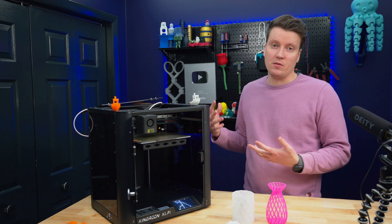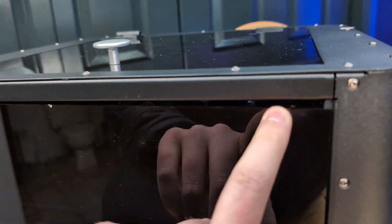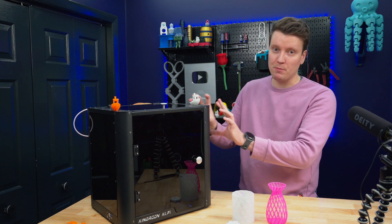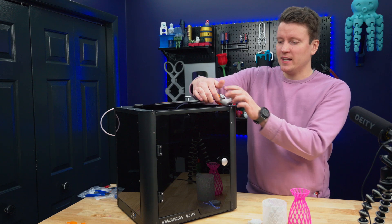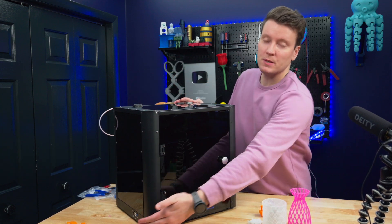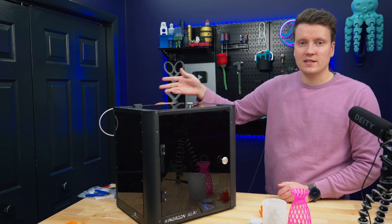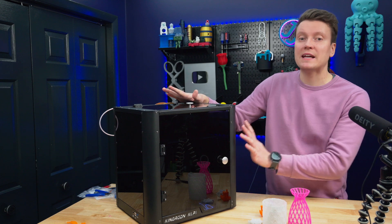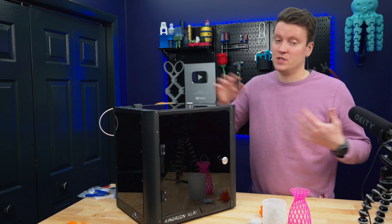This enclosure is not my favorite part of it. Most of my printing I did without the enclosure on there because it doesn't fit very well. There's a lot of panel gaps where you will lose a lot of heat. So if you want this for primarily ABS printing, you're going to want to get some foam and seal up those gaps. Another downside is that it's very dark acrylic, so you can't really see what's happening in there. Most printers nowadays come with a light and a webcam, but this one doesn't come with either. There are USB plugs on the left so you could attach your own webcam and power lights, either wired to the main board or via the extra USB port. It's very doable — you could make this a custom printer exactly how you want it. But out of the box, it's definitely lacking features that have become more standard on other printers.